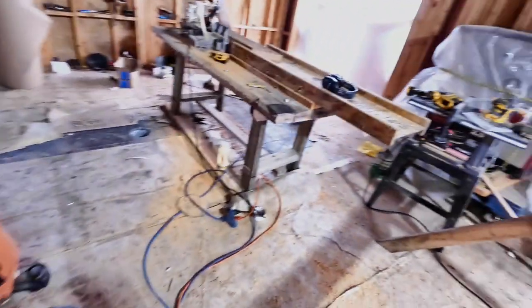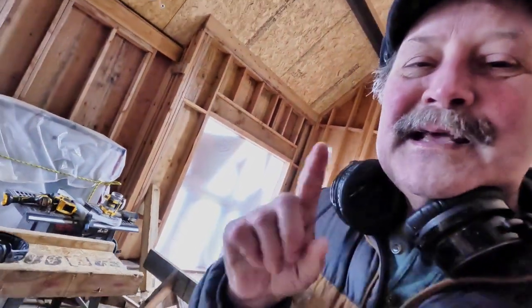Another thing I want to tell you about that I've worked on is when I first met with the concrete contractors back last April. This is the first time I've ever been a general contractor, so there's this division of labor. Who does what? I wanted to put electrical boxes into the floor of the concrete building so there's not cords running everywhere. They said, well, you've got to do that. I knew that. So I put together the conduit and the box, glued them together. And then they said, before they came out to pour the concrete, put them where you want them to go.